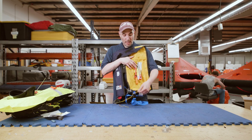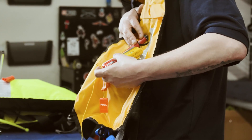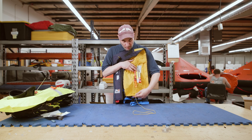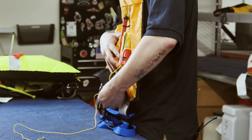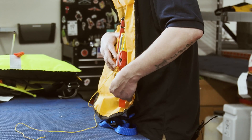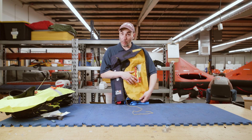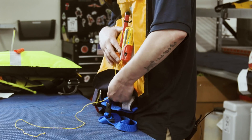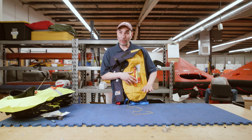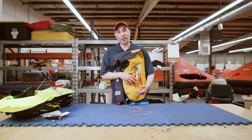This is how you want it on there. Now this is the automatic lanyard. What you would do is untie it from this section here and only leave this part hanging so it can pull. What's supposed to happen is you flip that up and tie it down so that when this flap kicks out it pulls the bottom piece off. But that doesn't always happen — not every life jacket is exactly like this. Some don't even have flaps. So always be ready to manually pull this with the Kannad slash McMurdo.